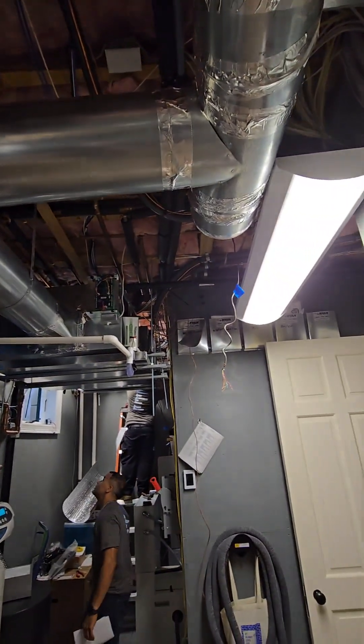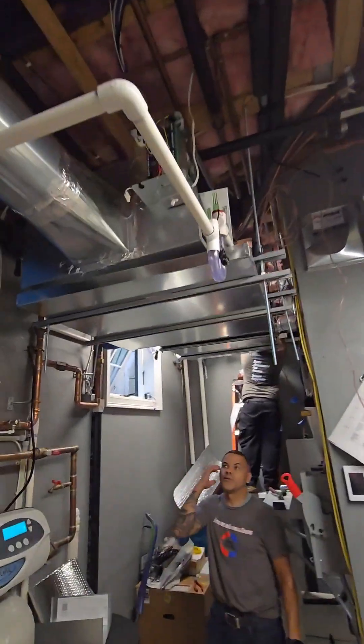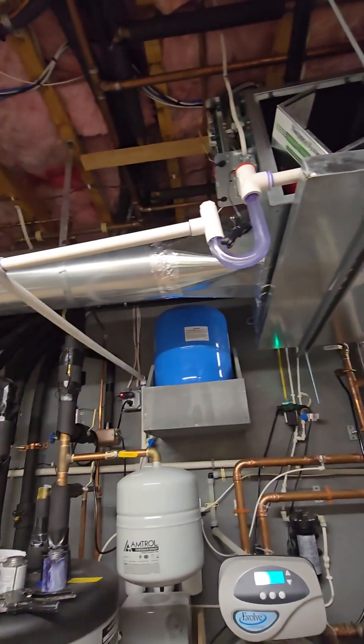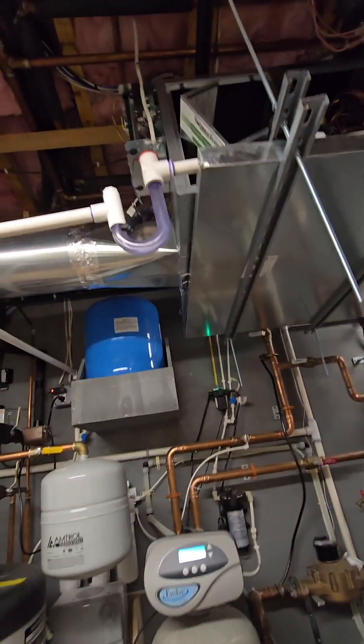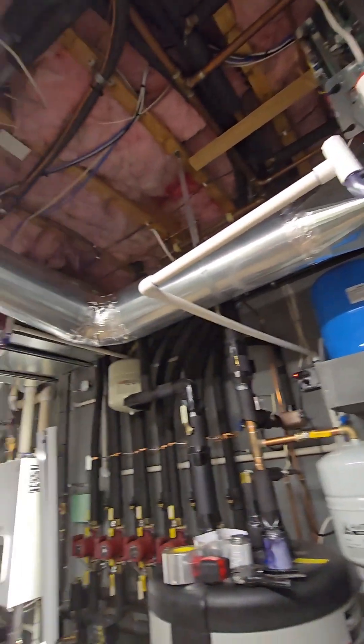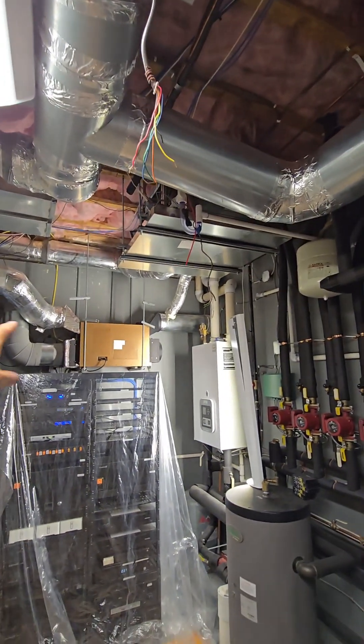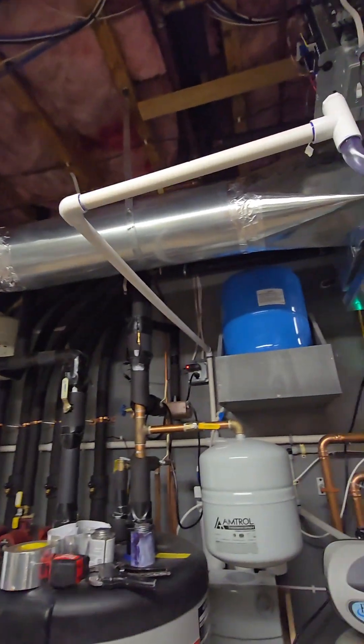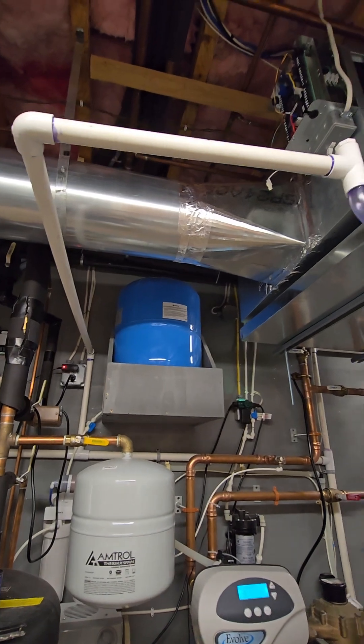What we're doing here is installing all new systems. Number one, they have new refrigerant piping going to the outside for new condensers that are sized differently. Now we also have to rerun a lot of this duct work because it needs more — you need more duct work, more airflow, better airflow to each room. We need more of those diffusers as well — high velocity diffusers.